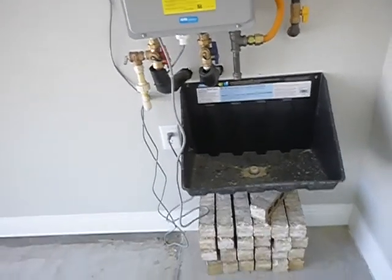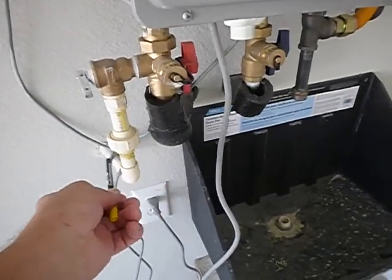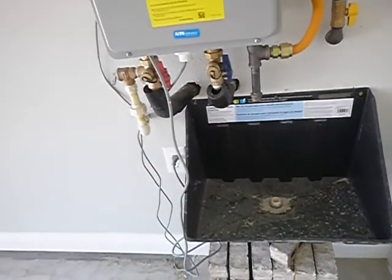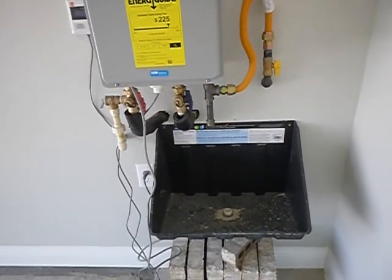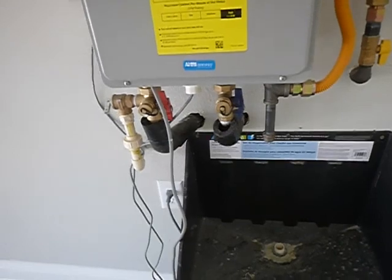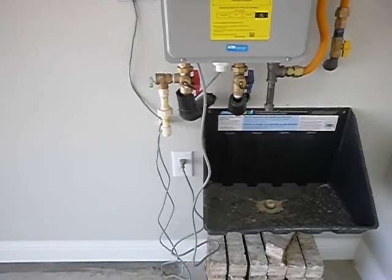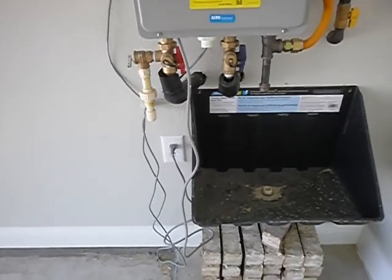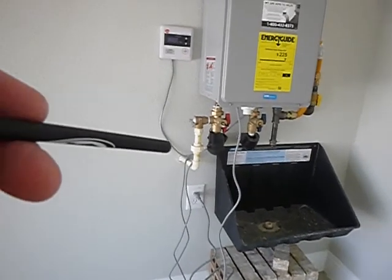And another thing, and this is Irving. I know we're in Irving, but in Dallas, and it's also the International Residential Code, the pressure relief valve should have a vacuum breaker, which means it just comes down and it stops and there's air there. And then it continues on, and that vacuum breaker helps water from, I don't know. To be honest, it's a tankless water heater and a conventional water heater for that matter. But somebody decided that was a good idea so that it doesn't cross-pollute and cross-contaminate, and I'm kind of stretching my imagination on how that would happen. But that is a Dallas code, a Dallas requirement, and we are in Irving, but it's also an International Residential Code requirement, so you might want to ask the builder about the drain.